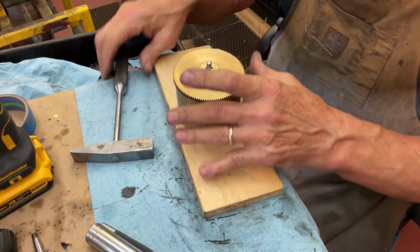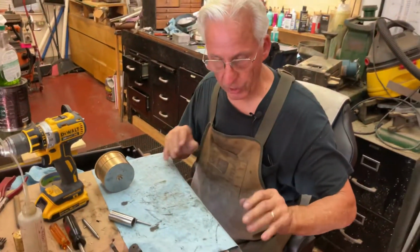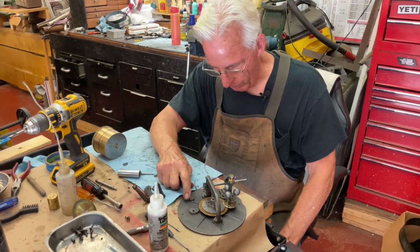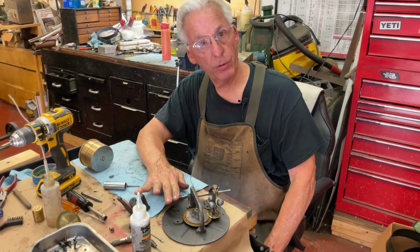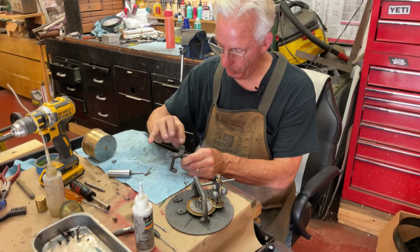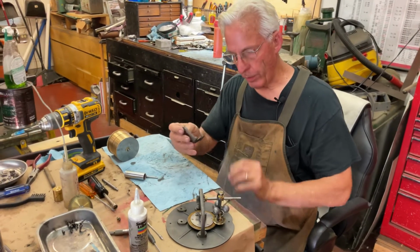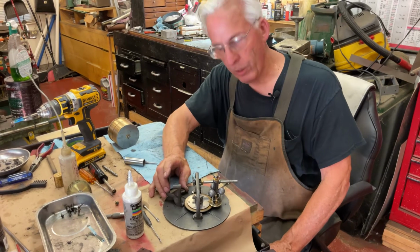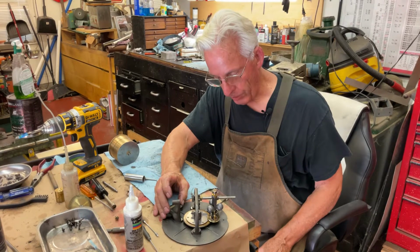And now in assembly of the motor, we're going to do a few things. Because this is over 100 years old, from 1901, I'm going to put a little sewing machine oil right here where the castings connect to each other. You're going to coat both sides and let the sewing machine oil soak in. We're doing this because when we bolt this together, we want it to be like it was originally. There's no rust, but we're just preventing rust.